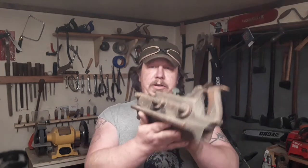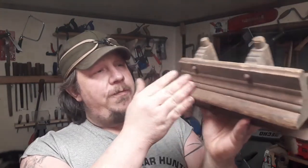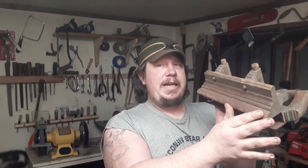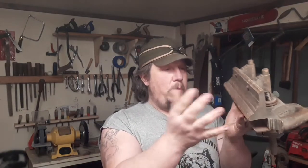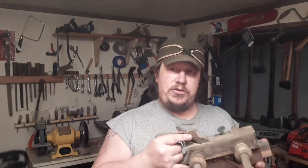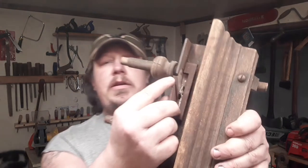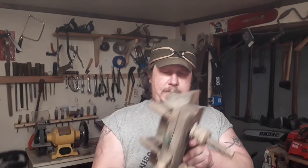These were kind of the centerpiece of planemakers. The wood has lovely designs carved into it from their other planes — their molding planes. Everything seems to work, all spins. I got one bad crack on the nut back here. These were typically just a plow grooving plane; you get a few different irons with them. This is your most common quarter-inch for drawer bottoms. This came from a cabinetmaker along with that router plane I got.